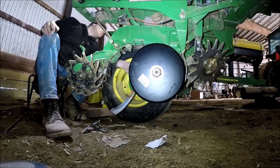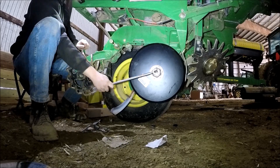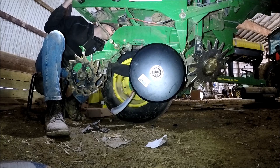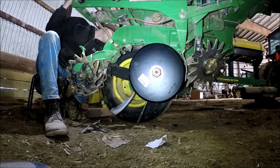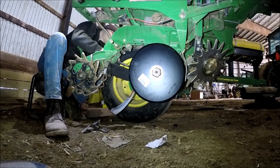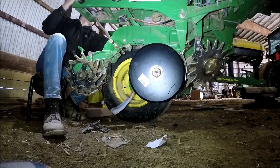If I only had to put one spacer in, I generally looked at the width — the distance from the cast arm from behind the seed disc — largely because I don't want the seed disc rubbing and catching and wearing. There's a lot that you're watching out for when you're doing these. I'm going to go through and make sure you tighten everything up. I think you catch me a couple of times where I go through and check just to make sure that it is tight.